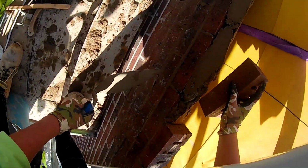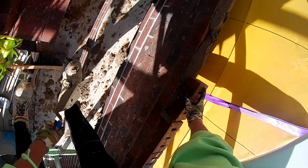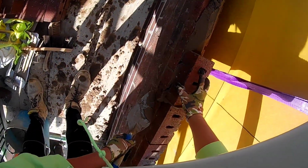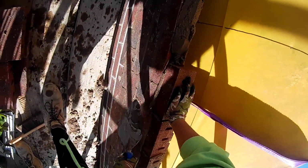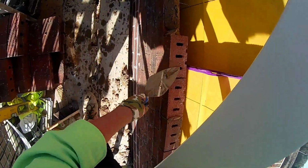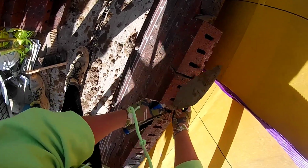You'll see in the video a brick suspended off the line at each side, and he just moves the clip up 75 mil and the line runs flush to the fascia and soffit, or the soffit, whichever one the bottom part is. But what you can do is use this technique, just pinning instead of tying your lines and pins around a brick, which will probably mess your line up in the long run.